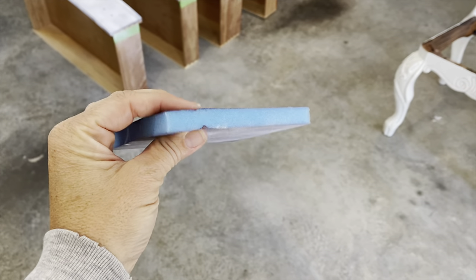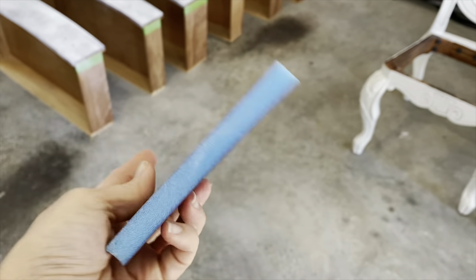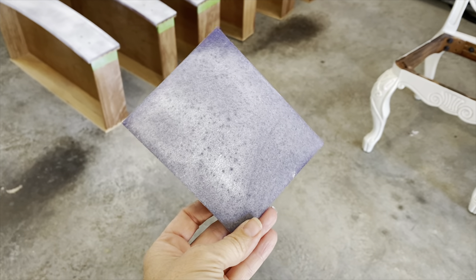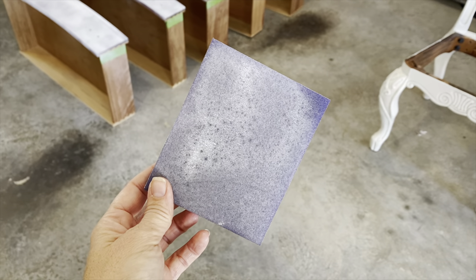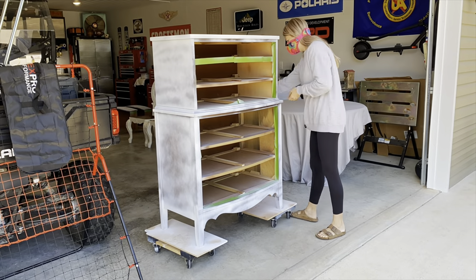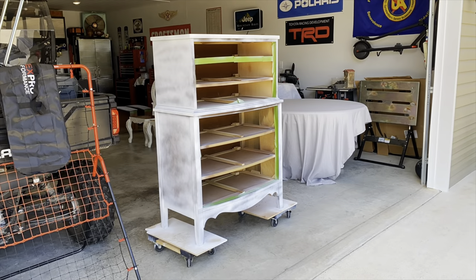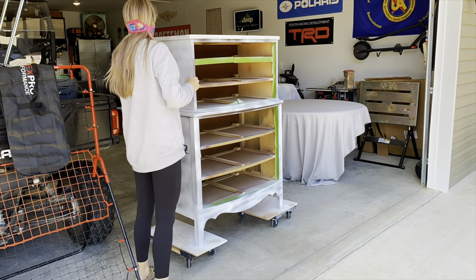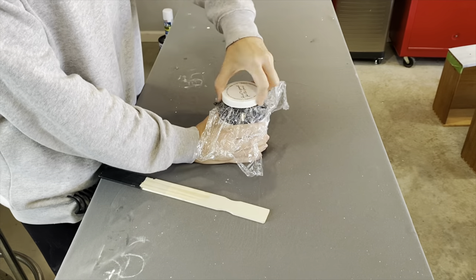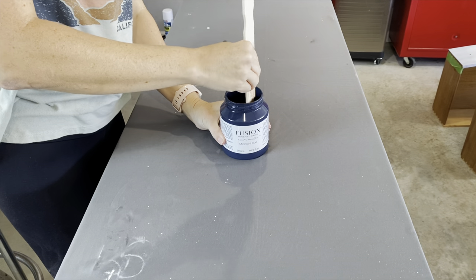Remember last week when we left off, we had primed everything. So now I'm going in with one of these foam sanding pads — I buy these on Amazon in a big pack. I'll link anything I'm using today down below, so be sure and check that out in the description box. I'm taking that foam pad and going over any surface that I primed, just to knock back any raised spots or anything that might have got caught in that primer. Then I'll go in with a microfiber cloth and wipe back any dust that might have been left behind. And you always want to make sure and stir your paint well — I just use a stir stick and stir it up really well.